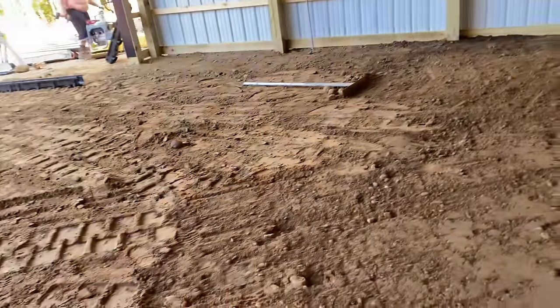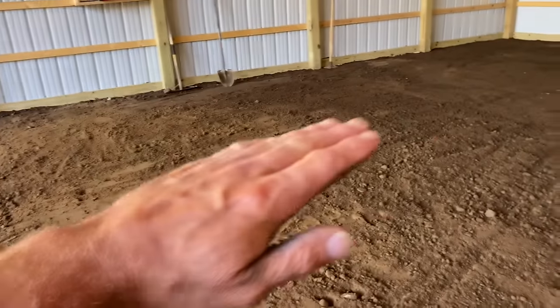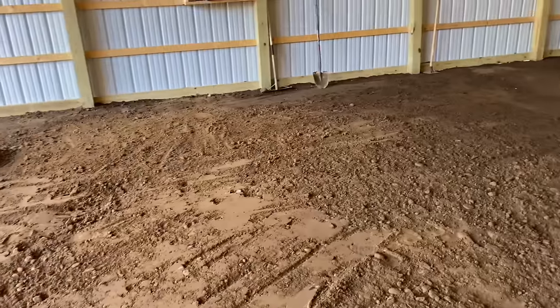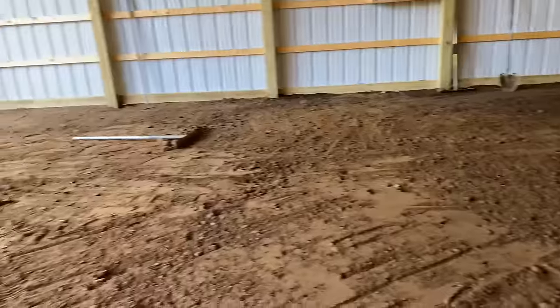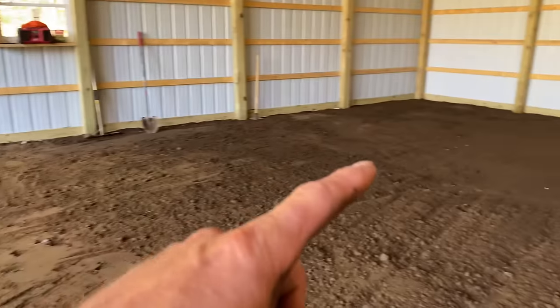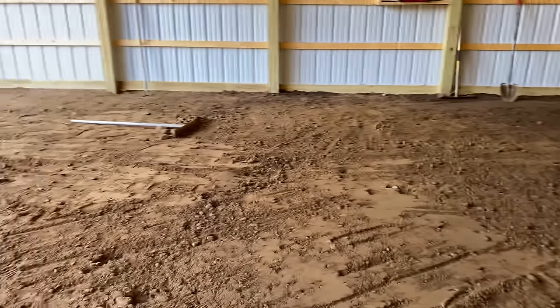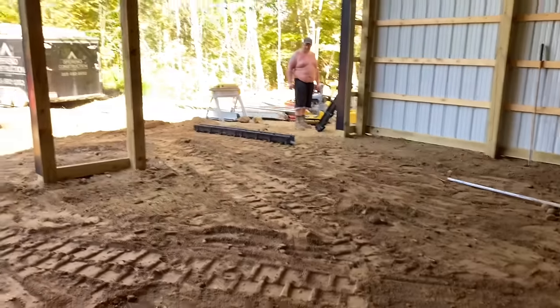So we got to basically figure out where we want it. Like I said, homeowner wants it 8 feet away. It's a 12-foot drain. And then we'll pitch, I don't know, probably 12 feet away from it this way. So we'll probably be somewhere in the neck of the woods where we stopped, where it's level. We'll start to pitch this way. That's how we're doing it.